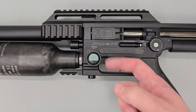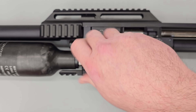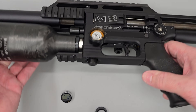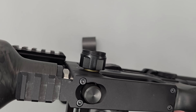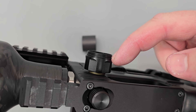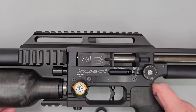The only other thing to mention is the O-ring between the bezel and the body of the gauge. As you install the bezel, make sure the O-ring isn't damaged and isn't getting caught between the threads or pinched between the bezel and the body — you can just make out this thin O-ring here on the side.